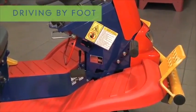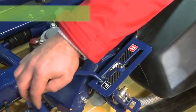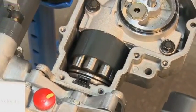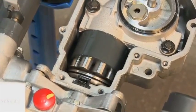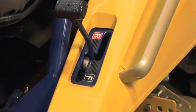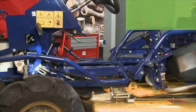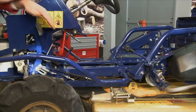The Razorbacks offer driving versatility. You have the option to drive the machine by either foot control, with a heel and toe action, or in many steeper hillside situations, you may prefer using the hand control. Either way, the transmission moves from forward to reverse motion with ease. The Razorback is also fitted with cruise control for long run applications. The instant that the brake is applied, the transmission shifts back to neutral, which stops the machine very quickly.